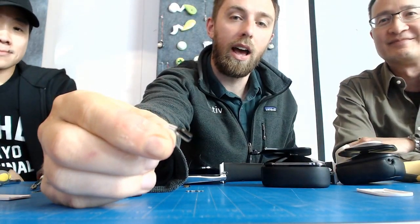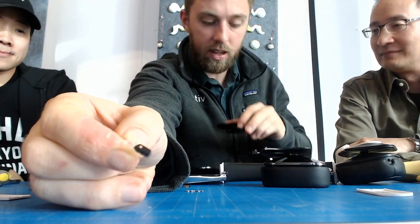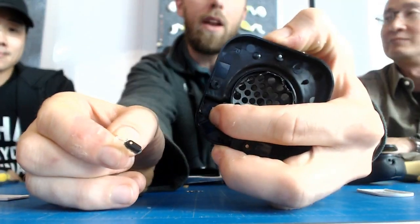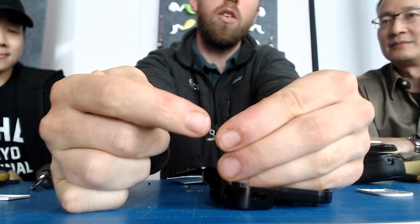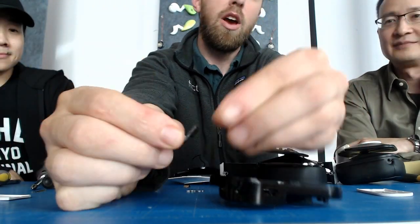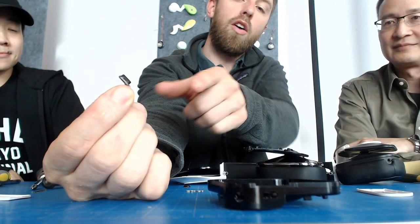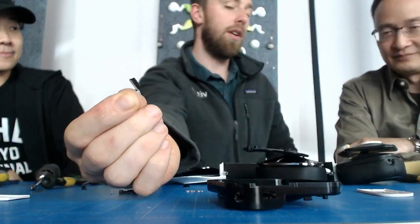Yeah. So it's a single molded polycarbonate part. We've then masked it and painted this, and then we laser etched that little dot off of it. What you guys couldn't see here is that there's a button right there. This sits onto the button right above where my finger is, and it gets heat staked, which means you take this hole and you basically mushroom it. You just put a soldering iron more or less on top, which holds this in place. And then all the light is piped through this actual piece and just shines out where the black paint is.